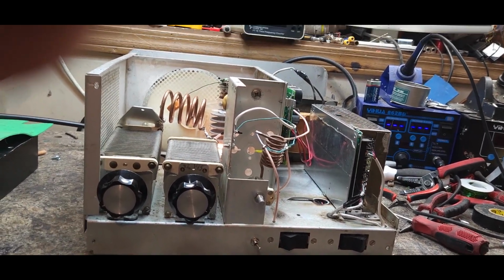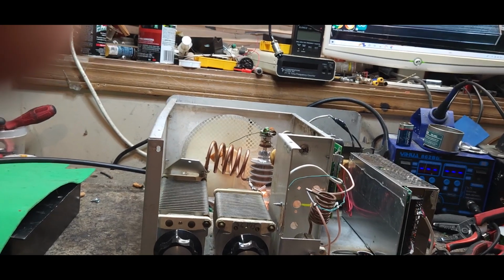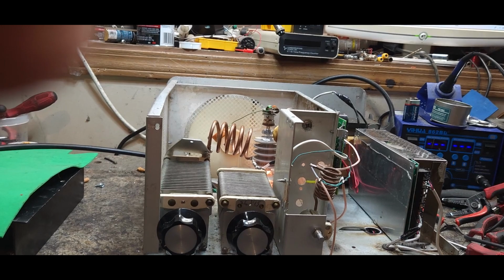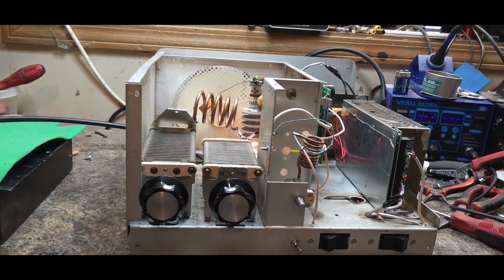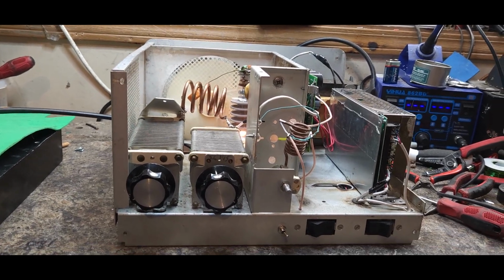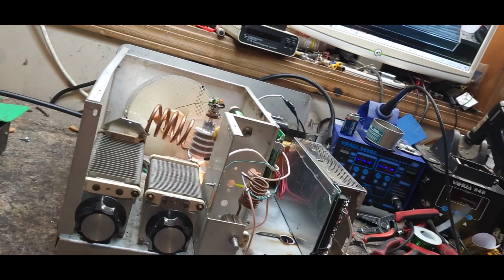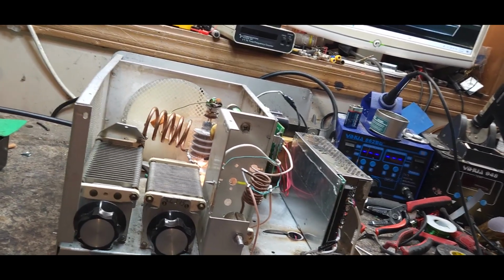So keep the tubes clean, guys. This thing wants up to 50 watts. We're only giving it 20. He's only going to give it 20 or 30 RMS watts. This tube should outlive him, me, and both our kids. It's the way to run these tubes. And for those of you putting these things together, a little tip on these tubes: it says 5.1 volts. Run it at 5, straight 5. That 0.1 volt means a lot.